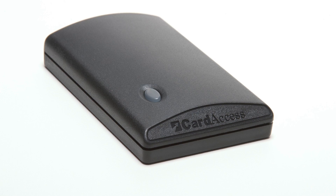The Z2IR is powered through this mini USB port. The Z2IR is not a USB storage device — its USB port is for power only. On top of the Z2IR is an identification button for identifying it into your Control 4 project. This button also doubles as an LED for information and diagnostics.